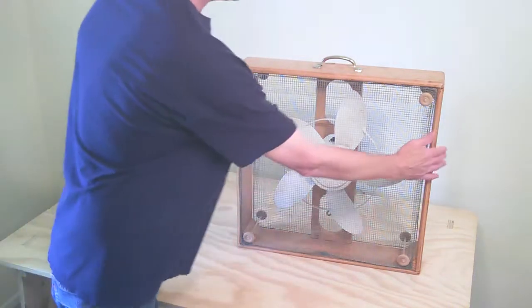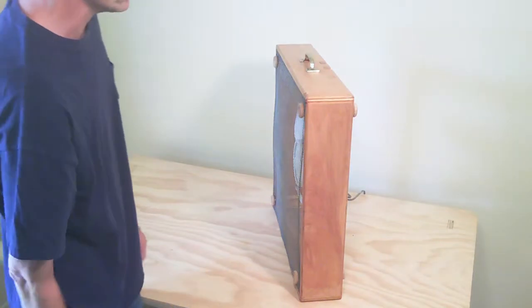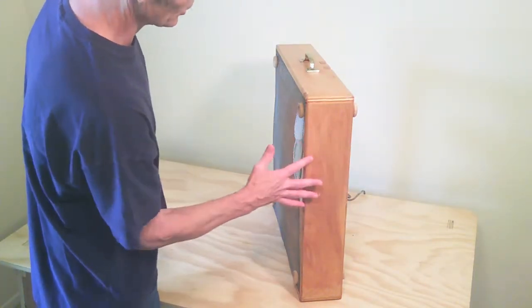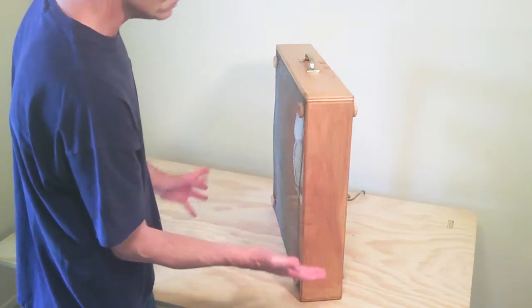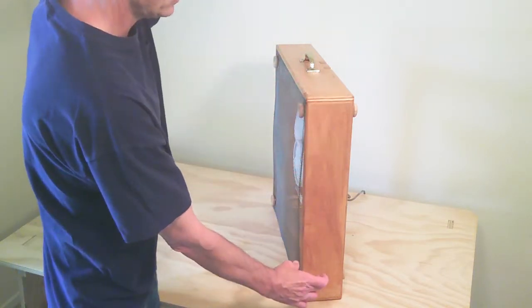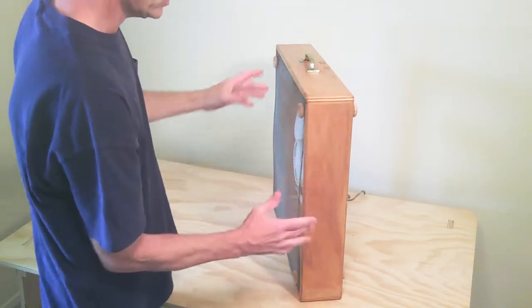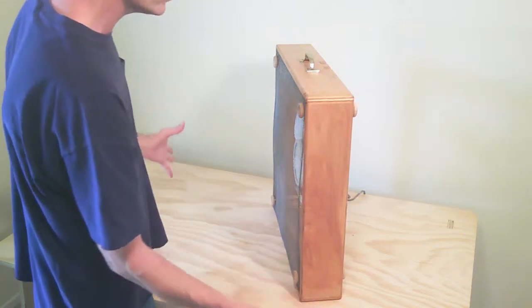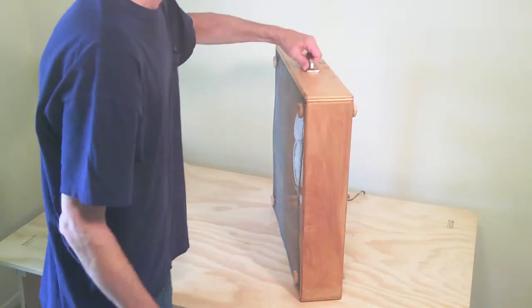What I did was real simple. This is just Baltic birch plywood, and you could use a cheaper grade, and this is 5 inches across here, and I just ripped these on the table saw. You can do this just as well with a jigsaw. Put a straight edge on your length of plywood and just follow that straight edge, and you're going to get probably nearly as close to a straight edge with the jigsaw. It's just a little more concentration and it takes a little longer.